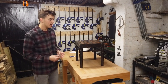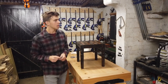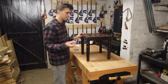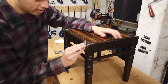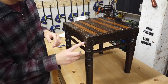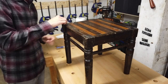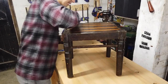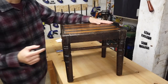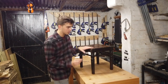If you do this at home you might have some glue squeeze out. To remove that you can use some sandpaper, but I don't want to be too aggressive because I don't want to remove the finish. So you can get some wire wool — I have 00 wire wool, or you can get 000 wire wool if you want to go finer. This is less abrasive than sandpaper, and you can rub it along the glue seams to get all the loose squeeze out off. If you've got a lot of squeeze out you can use a chisel, but be careful if you want to keep that finish. Wire wool is also good at blending areas together, but it does make a matte finish — and this table has quite a nice shine, sort of a French polished finish, so I don't want it to go matte.